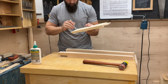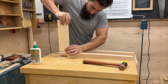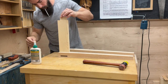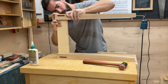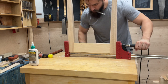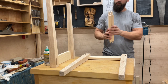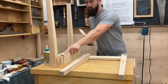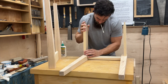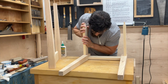The glue-up is something I want to talk about because gluing up a table like this is generally done in two stages. I'm gluing up an A-frame — meaning two legs and one apron — and I'll do two of those individually: glue up the first one, throw it in clamps with a little glue on the mortise and tenon, set that aside, glue up the second, set that aside, let them rest for an hour or two. Then I take those out of clamps and do a much easier final glue-up because I have two whole components. Gluing in stages when working alone is the easiest practice.